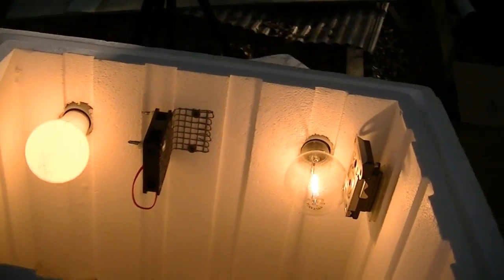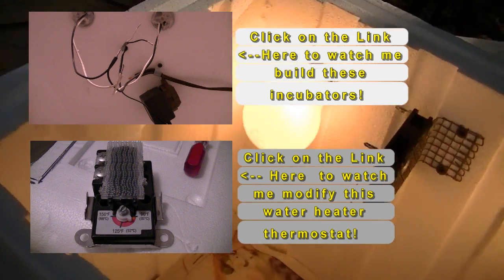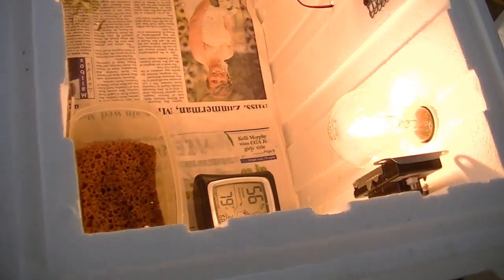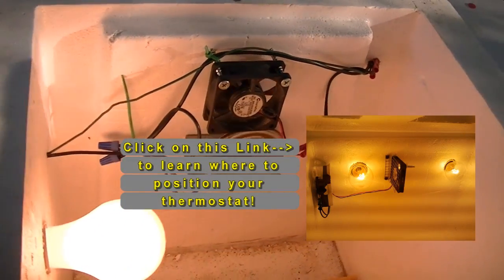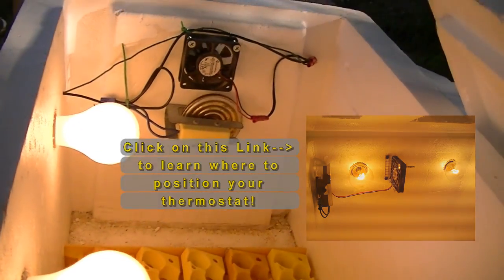All right guys, I hope we kept that simple enough so you can understand how to wire it up. We'll try to get back with another one as soon as we can. Wade Rush, Rush Lane Poultry, Central South Carolina — hope you're enjoying this beautiful weather. Notice that the modified water heater thermostat is very close to that trigger bulb, and the fan is positioned blowing over that trigger bulb right onto the thermostat to make it cycle faster. Also notice that in this box the GQF wafer thermostat is in here — it's not as critical where it's mounted; it doesn't have to be near the bulbs. As long as it's out of the way and in a good position in the box, it'll work best. Thanks for watching, guys.